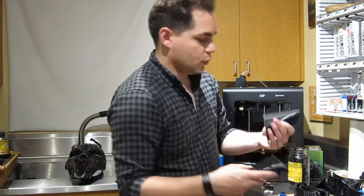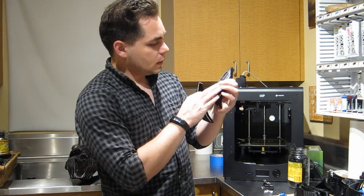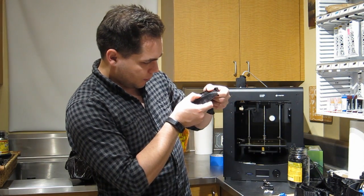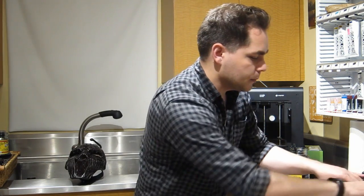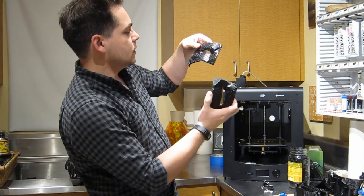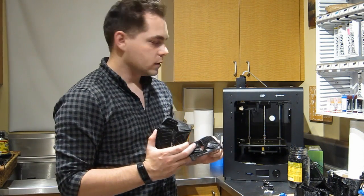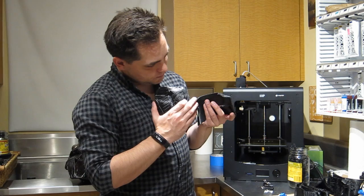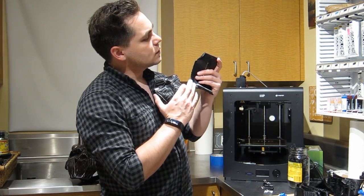I finally got the prints. These are nice. These are very, very nice. Very smooth. That's kind of a weird pocking that came up. I don't know why that was, but these are very nice. The only issue was to get it to stay on the print bed solidly, I had to make a raft, which made the bottom layers of these really rough, and I don't know why they look kind of melty.